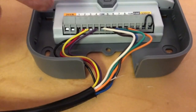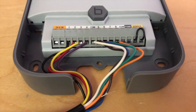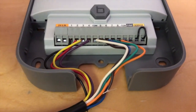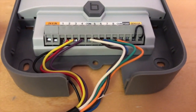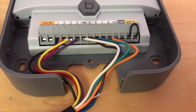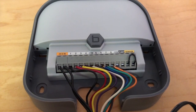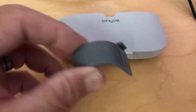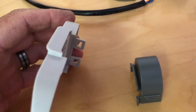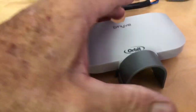Next we need to install the 24-volt AC connection. Just in case you've never done one of these before — make sure it's not plugged in before you start playing with the wires, because you're going to touch the two leads together and get zapped, or trip the circuit breaker, or both. Install it first, then plug it in. Let's get the transformer connected. Our leads are now connected and all we have left to do is hang the timer on the wall.